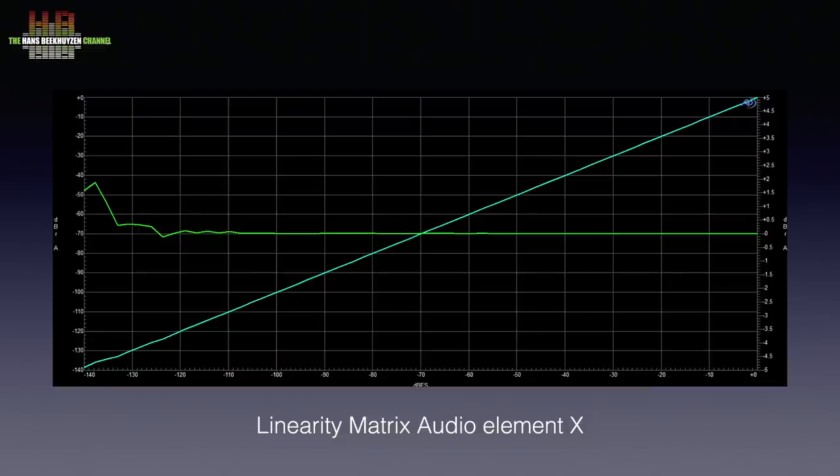It represents the relation between the digital level and the analog level. The turquoise line represents the measured relation between the digital and analog signals. So if the digital signal dictates a signal of minus 120 dB on the horizontal scale, the analog output should be at 120 dB below the maximum output of the DAC. The green line shows the deviation using the right vertical axis. There is next to no deviation at minus 120 dB — even at minus 140 dB the deviation is only about plus 1.3 dB, most likely due to noise. You also see the noise floor, and that the jitter must be very low, since with low-bit converters like these, jitter can also affect linearity.